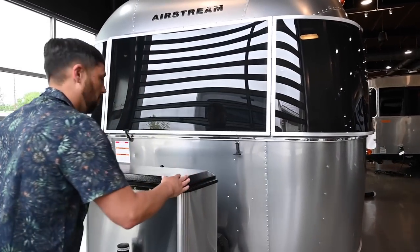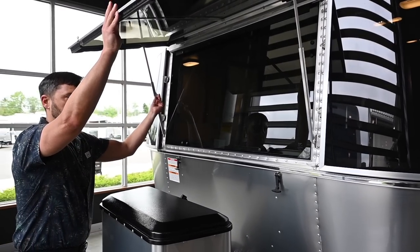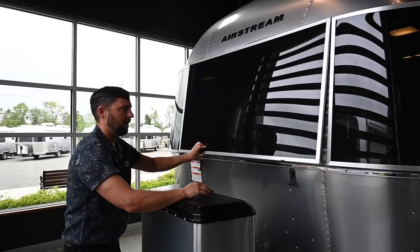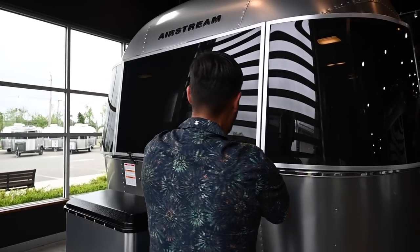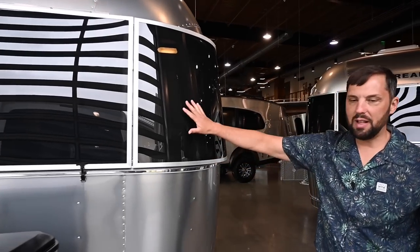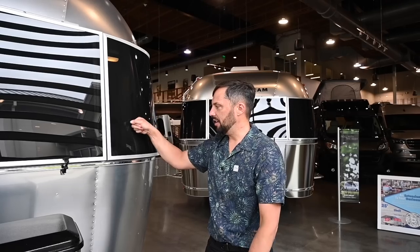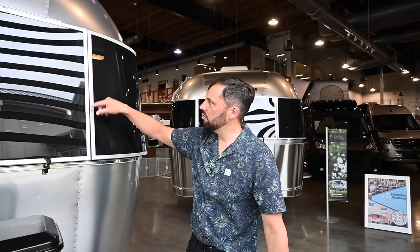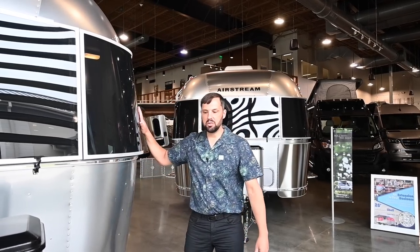The rock guard — solar stone guards — has tethers that come up, and this lifts up. These knurl knobs lock in place and allow you to open the window three different heights. This window also has an insect screen built in. The corner pieces allow some deflection if debris comes up — there's tempered curved glass behind, gapped to allow deflection. You may get leaves and debris back there, so you can take a screwdriver, do a quarter turn, and these will swing out and slip off the hinge so you can do maintenance back here.